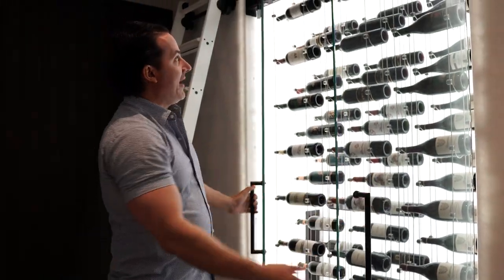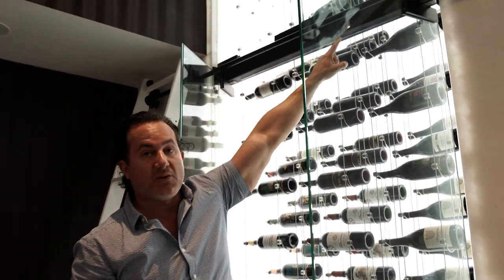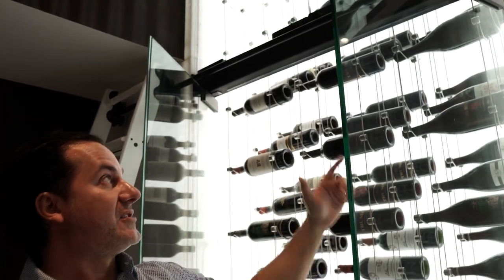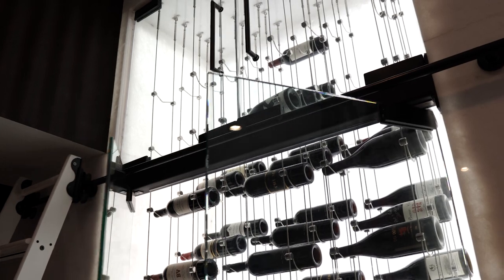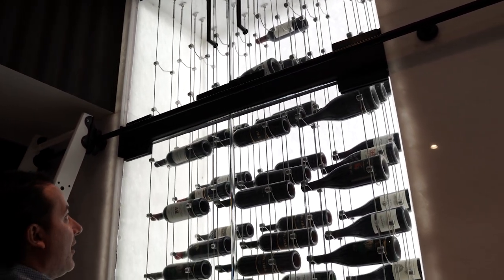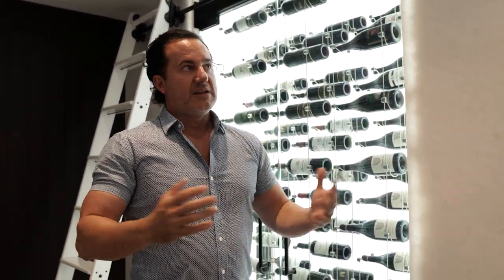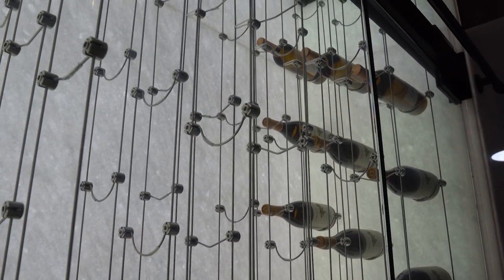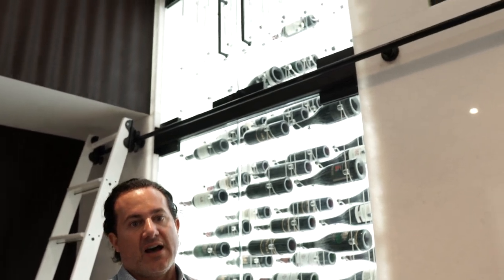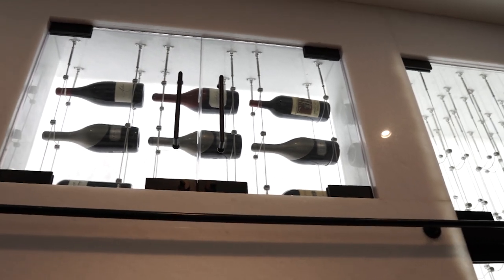Now you can freely open the doors, and door stops prevent them from hitting the racking. We also installed a metal bar beam at the top to create a proper seal so the doors seal correctly from top to bottom. Needless to say, we knew what was wrong from the minute we saw it — the cooling, the doors, the racks, the way everything was installed. We came in and had to rip everything down back to the studs and rebuild the room.